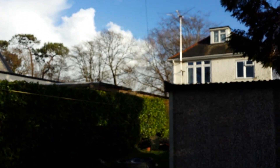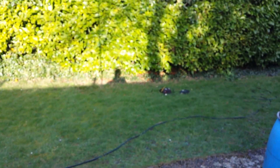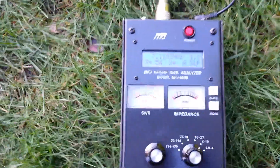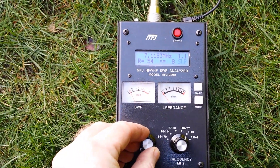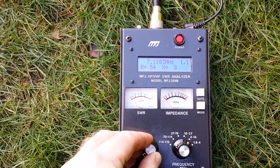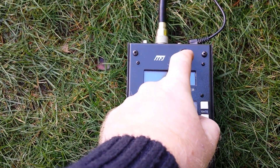The wire goes all the way up the pole and then back down. After that it's just nylon all the way down, literally just to hold the tail out in a workable fashion. Moving over to the meter now — it's quite narrow-banded on 40 metres, which is understandable because it's choked.